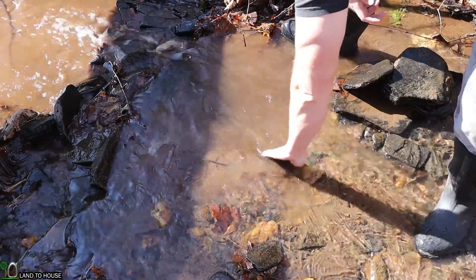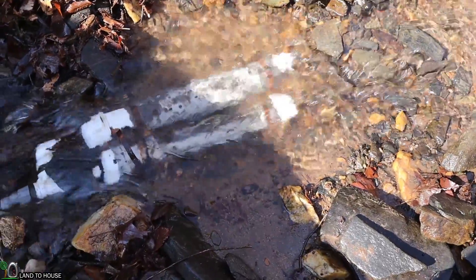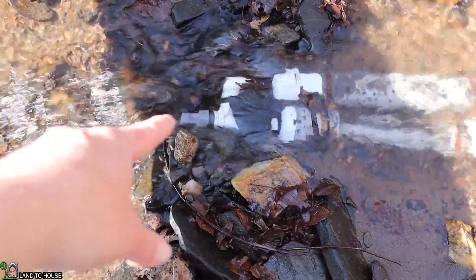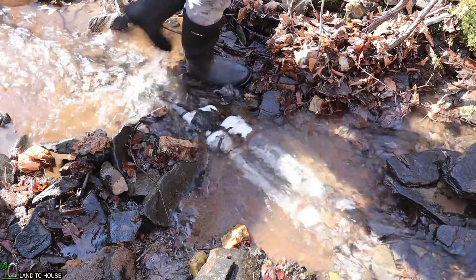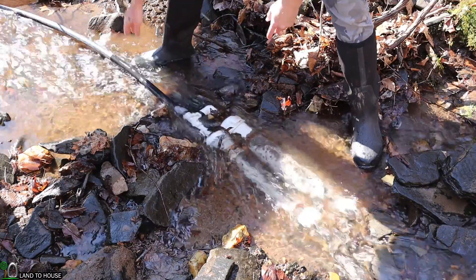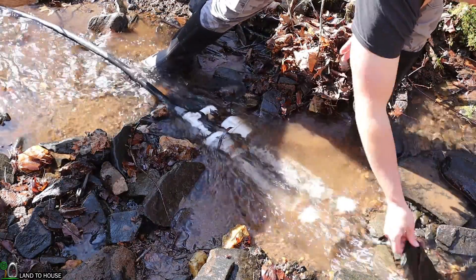I managed to get all of the wintertime silt away from my intake pipes. What I have are two 3-inch pipes with a whole bunch of holes drilled into them and then window screen put on top of that. It essentially just pulls water in and sends it into a little tee and out the adapter. Now it's time to get the black poly pipe attached, and I'll put some heavy rocks on top to prevent it from lifting back up.